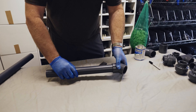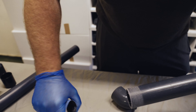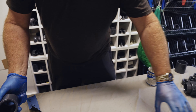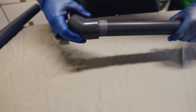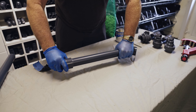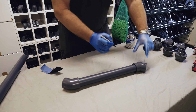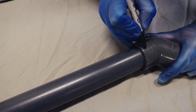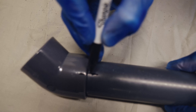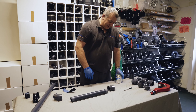We've quickly taken the shine off both sides. If you're doing an intricate piece of pipework going off in different directions, you don't want to glue it all in one go — here's a little tip. Get all the pipework laid out before it's glued, because once you glue it with solvent weld you've only got minutes or even seconds before it sets solid. Dry fit it, then use a black permanent marker to draw a small line across the joint on both pieces, so when you take it apart you can put it back together in exactly the same position.